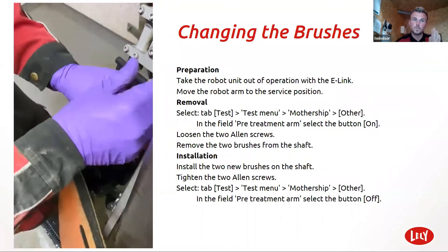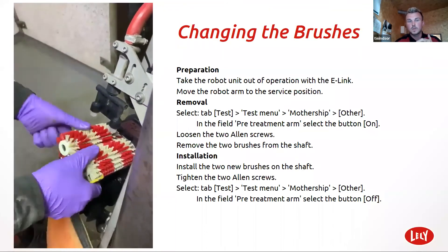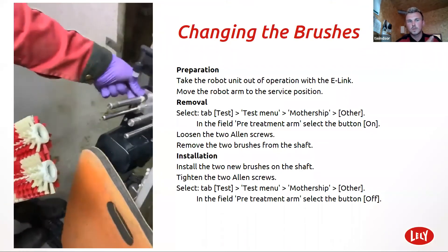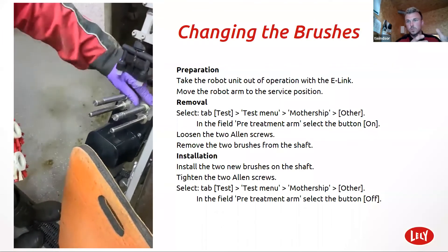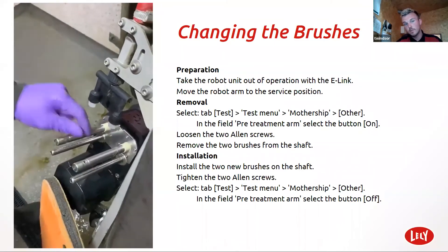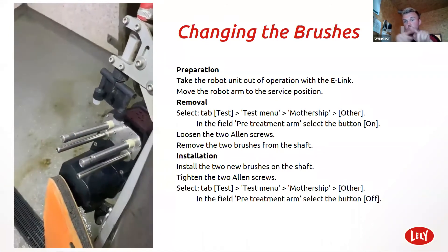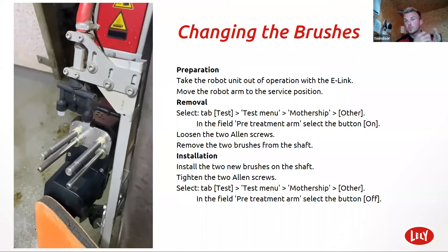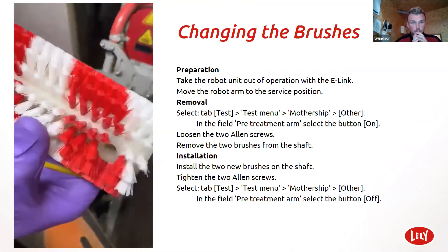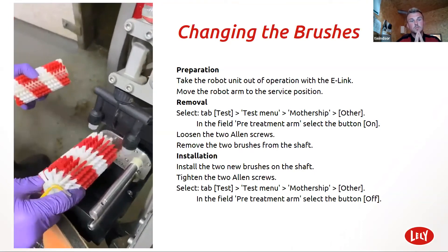Removing the brush from the motor is actually quite important because if more hair gets jammed, the rollers won't spin and then it's a new brush motor. So it is very important — cleaning that hair from underneath the brushes. Two screws and another two-minute job, and it could save you a massive cell count with a few cows. Like I said, 30,000 milkings, or farmer's discretion if you want to change them sooner. But I wouldn't advise to change them over 30,000 milkings — you may start seeing your milk sample going up for your cell counts. 30,000 milkings maximum, I would say.